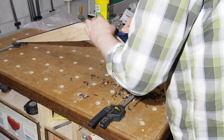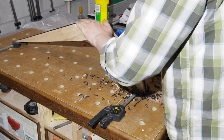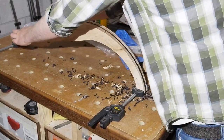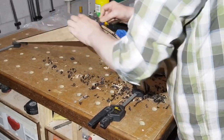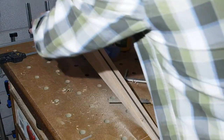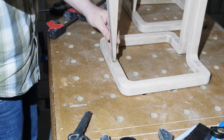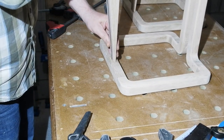Time to glue in all the pieces — the fit is good and tight and once tapped in, is going nowhere. Spokeshave for the win to bring down the blackwood inlay. Didn't take much doing despite protruding two or three mil. Very interesting wood to work — I swear it feels like you're working plastic at times. Next, the freshly sharpened spokeshave is again used to sculpt the leg — basically a round-over, but graduating: a large round at the centre where it's thickest, then graduating to a very slight round at each end.